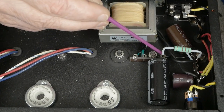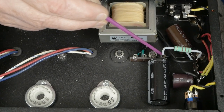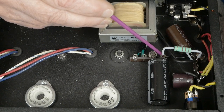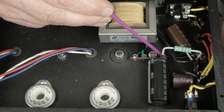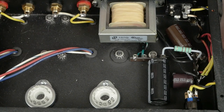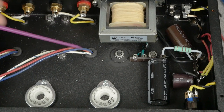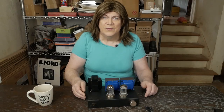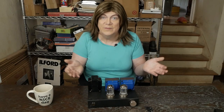On this connection here and on this connection here, I just soldered the resistor right at the top of this tag strip hole and left this open, because we're going to be connecting some wires from here over to another tag strip when we get to wiring up the plates of the other tubes. So this looks like a good place to wrap this up — I've got some parts on order and we'll get back to this probably first of next week. It's nice to see this thing starting to come to life.